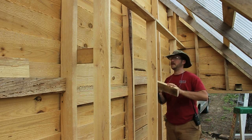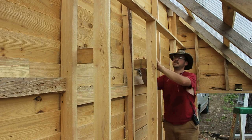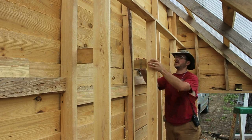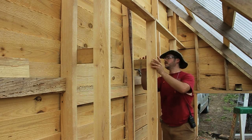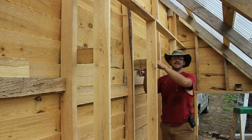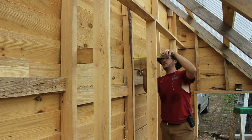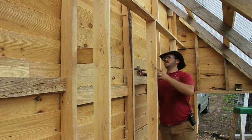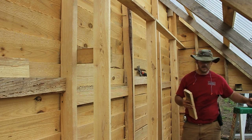I'm adding some brace pieces onto the back — these little upright pieces ensure the distance is the proper spacing from the back of the fans to the back wall, and also give this scaffolding a little more support. Ideally you want about a 10-inch dead space behind your fans, and that's what I'm going for here. It's not exactly 10 inches everywhere, but it doesn't have to be perfectly exact.